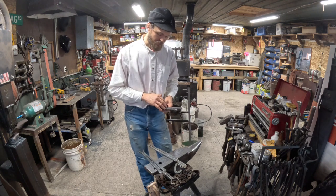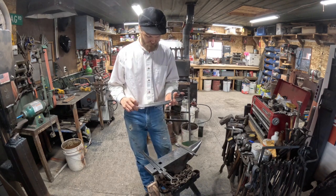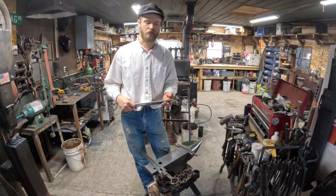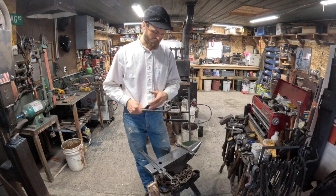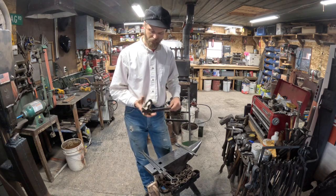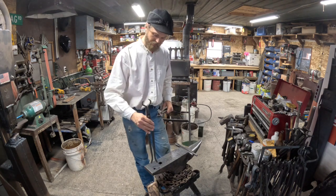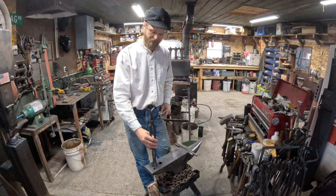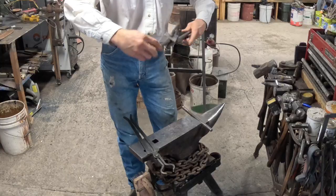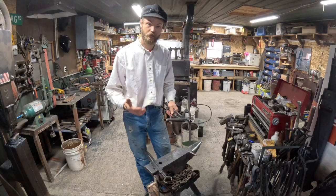If you don't have a lot to work with, you can just use some quarter by three quarter or quarter by half inch tongs stock, and then pretty much just make your bends that way. I use these a lot, even though these were some of the first tongs I made, to make nice pickup tongs like these. So they're pretty nice. You can grab steel this way or this way, so that makes it quite nice.